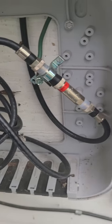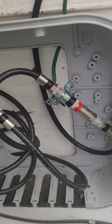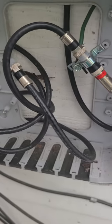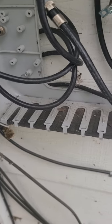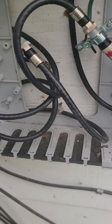Now, I mentioned the wire will be coming in from the pole, but that's not always the case. If you live in a subdivision, it could very easily be coming in from underground. If that's the case, it'll be running straight up the wall, straight up into the bottom of the enclosure box. It's typically an orange wire, but if it's older it could be black. That's the one that's going to have your signal on it.